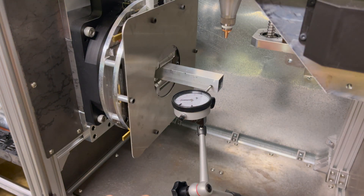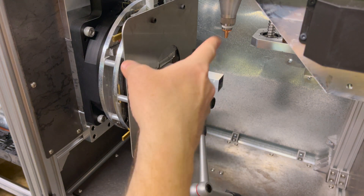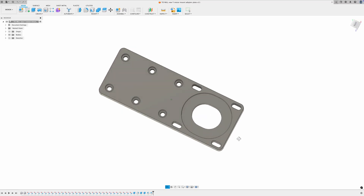After these adjustments I'm about 0.25 millimeters difference on the X-axis and about 0.7 millimeters on the Z-axis — it's a lot better, still not perfect. I'm not sure how perfectly straight an aluminum square tube is; that's the best thing I have to test at the moment. The software does have some centering functions where it can use the nozzle to check for center and create offsets. I've designed a new motor mount for the Y-axis, so let's get that machined.